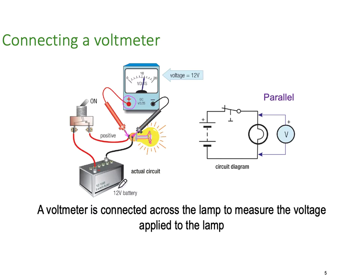So it's important here that we've got a 12 volt battery, and because there's nothing else in our circuit using any of the voltage, it's only the load, then of course you can see it's measuring 12 volts on the deflection scale. But remember, it's measuring the voltage across the load. We're not necessarily measuring the voltage across the battery. So as I said, it's in parallel, and here's our load, here's our meter, and our meter is in parallel. So all voltmeter measurements are always done in parallel.